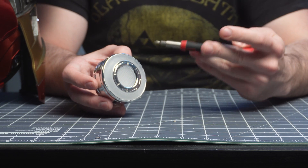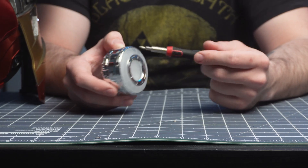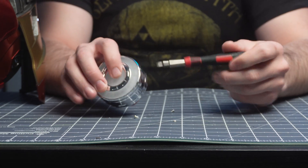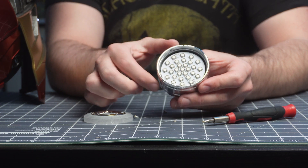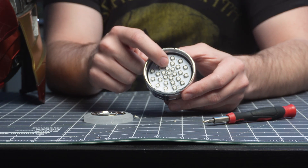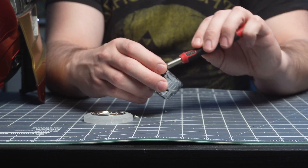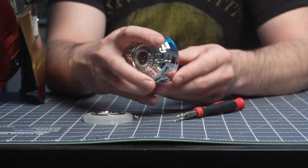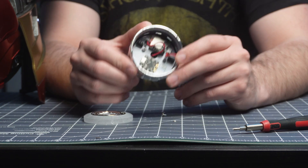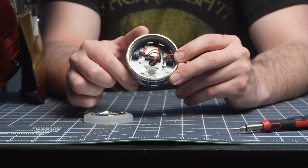The new unibeam is composed of only three 3D printed parts: an inner bit, an outer chrome-electroplated casing, and a clear resin printed part for the light. Undoing the two screws pops out the clear piece, exposing the NeoPixel grid — a custom PCB I designed myself. There are actually two PCBs inside: the top layer with the NeoPixels and a bottom layer with all other electronics. On the inside you have a DFRobot Beetle microcontroller similar to an Arduino Nano and a DFRobot MP3 player triggering sound files.